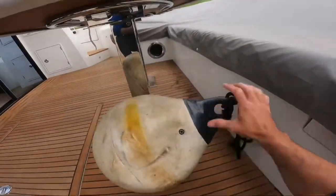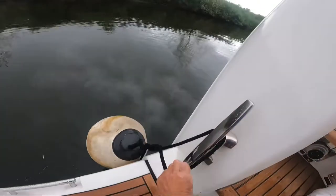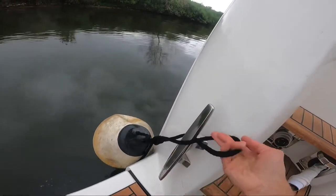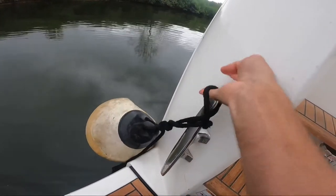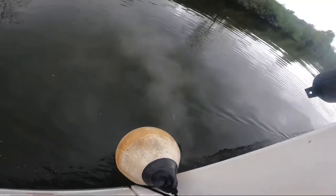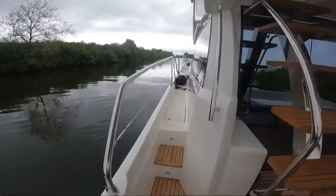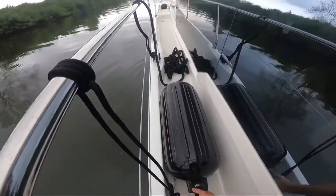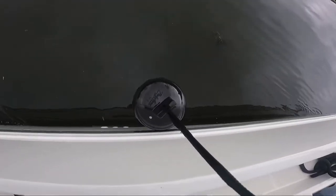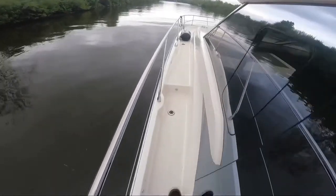I've got another ball fender — I like the big ones here just to help protect the stern swim platform. I'm going to do a little loop here. It's got a nice distance out, which gives real good protection between the lock wall and the boat. The swim platform always has potential for getting dinged up. Nice wide walk-arounds on this boat. I've got these pre-set up because you don't have time to waste when single-handing. These are my lines that I'll use to fix to the floating bollard, which I'll discuss as we get there.